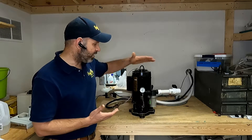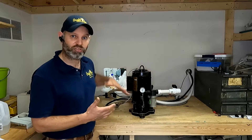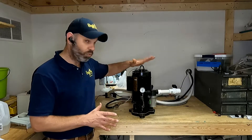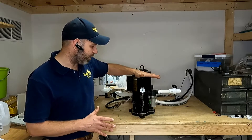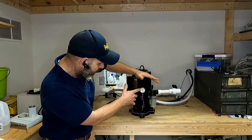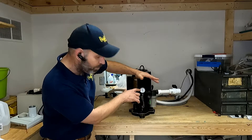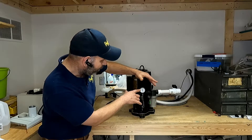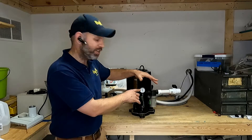In order to test the pump, we test with the system closed off — no demand — and we're going to go ahead and block this relief valve. What we're expecting is for this number to go up above 25, which would indicate a very healthy pump. I'm blocking it off fully right now and we're hitting about 17.